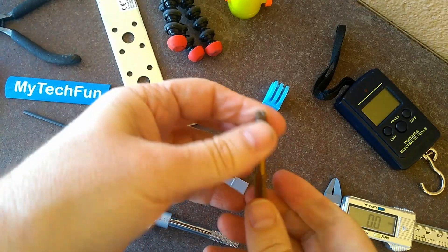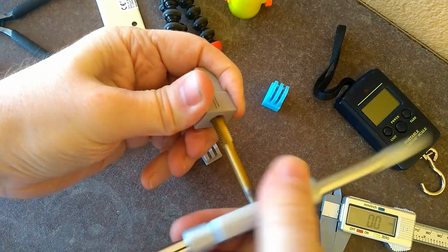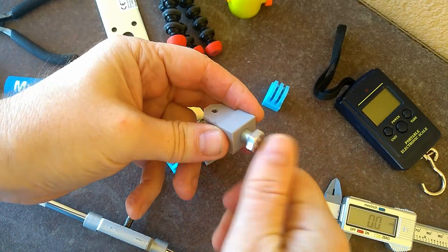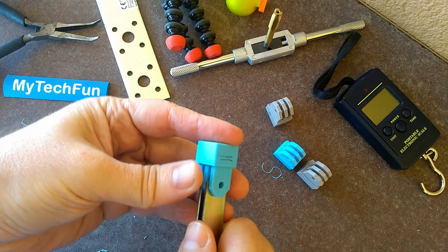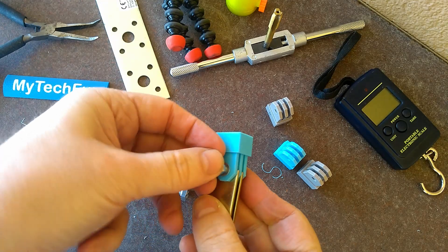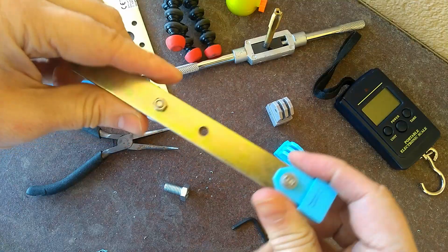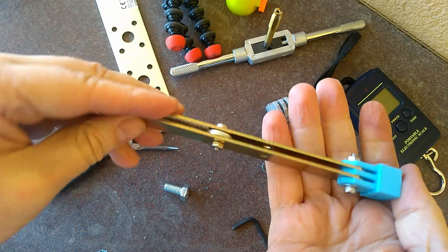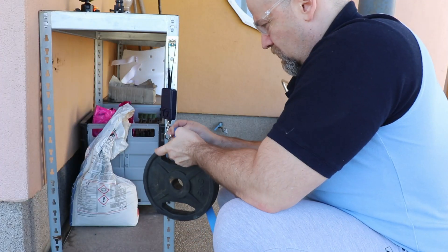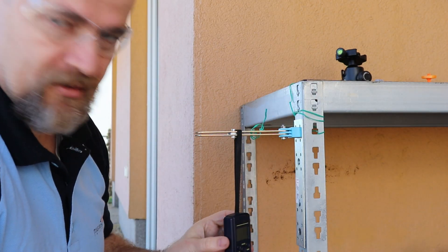With the horizontally printed version, the screw couldn't go in, but I have the correct tool - an M8 tap tool - and after using it the screw goes in very easily. Let's put this test probe together. This cord is just to secure it so when it breaks it doesn't fall down the scale.